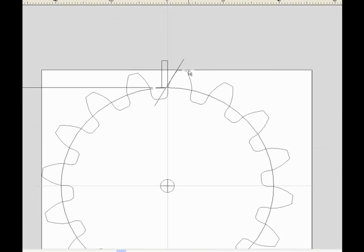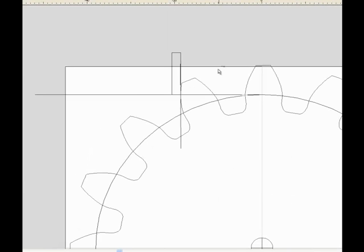Now, when we rotate the gear enough that that tangent point is vertical, that's the involution point of that gear. That is the point, if we measure the length of the string that we would have had the string been unwound to this exact point and moved the tool to the left by that exact amount, the two of them should be meeting up at the perfect tangent point. For example, like this. Okay, so here I have moved the tool to the left by the length of our string, which would have been unwinding to create the involute point.